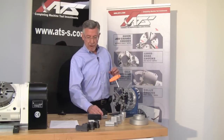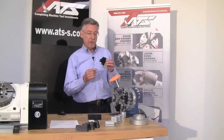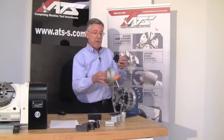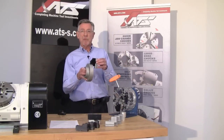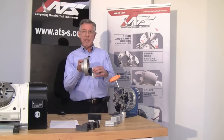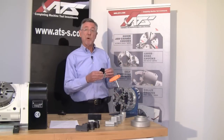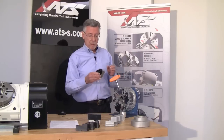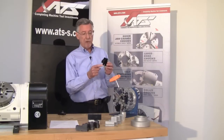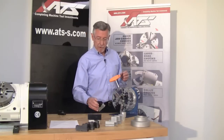For first operations we use the job shop jaw. The job shop jaw has sharp teeth to bite into the workpiece to give you maximum driving torque. This tooth will allow you to grip on the outside diameter of the workpiece, and the same tooth will actually grip on the inside diameter. Three sets of these jaws cover the chuck's entire gripping range, both OD and ID. Note the tapped holes here to allow you to put in different height rest buttons to customize it for your workpiece.